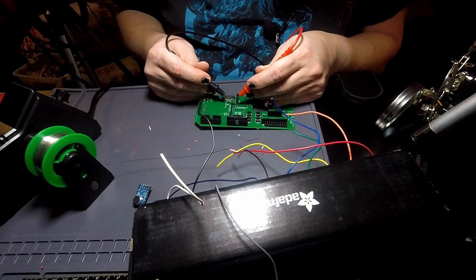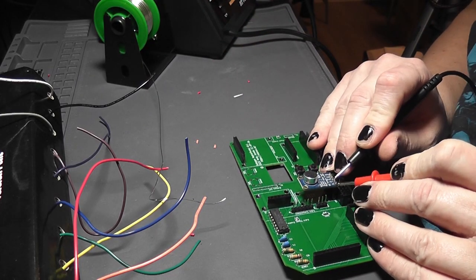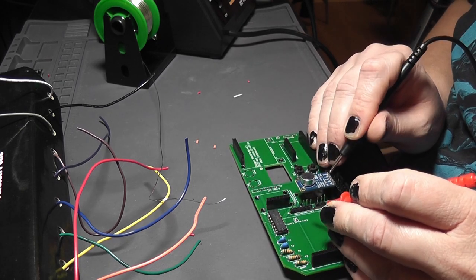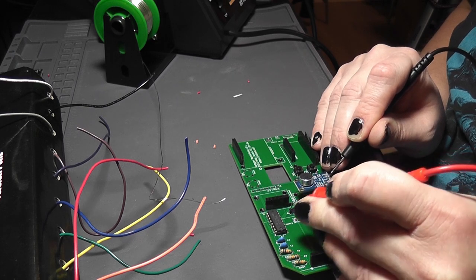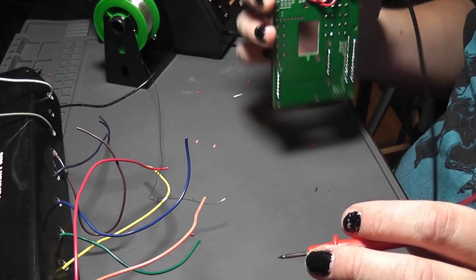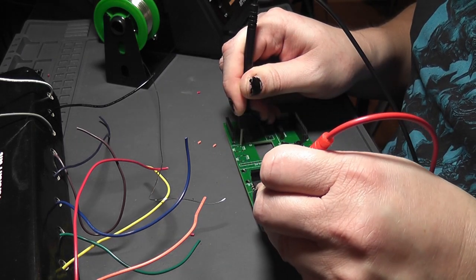Those don't ground, those don't short, these don't short. Ground goes to ground, VDD goes to VDD, out goes to this, or actually is it this, to this, that one, and is it that one? It is supposed to be that one. Okay, there, bodge wires are complete, and one last check between 3 volts and ground, and ground and ground, okay, 3 volts and ground, nothing.